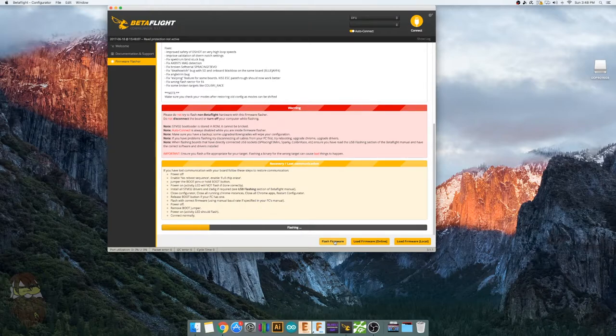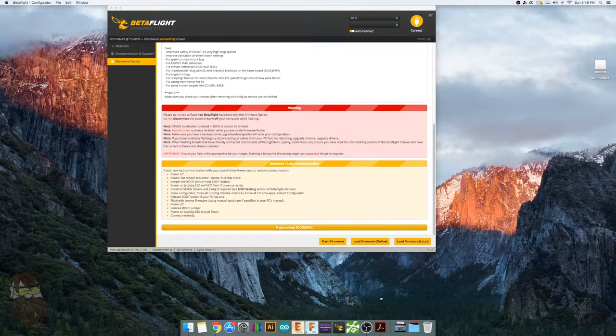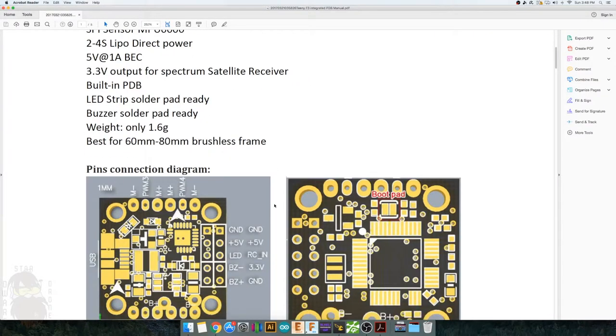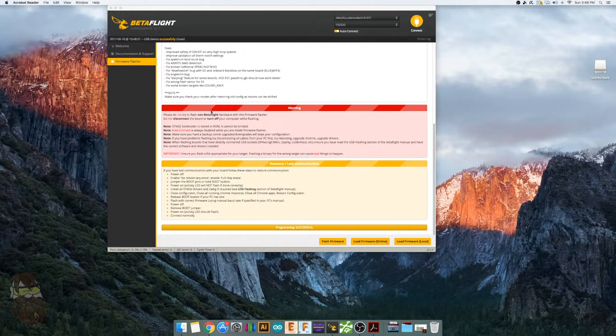If for any reason it says failed in this little progress bar right up here, you're going to have to connect the bootloader pads. I'll show you in the schematic where they are. I'll also include this PDF file, with a download link to it in the description. Your bootloader pads are right here, under the board, right next to the microcontroller chip. Okay, let's just get that out of here.